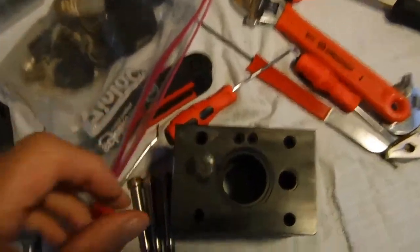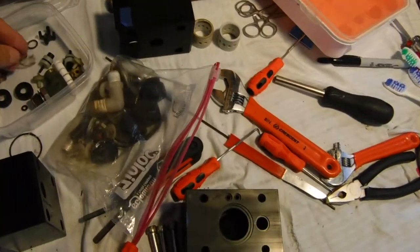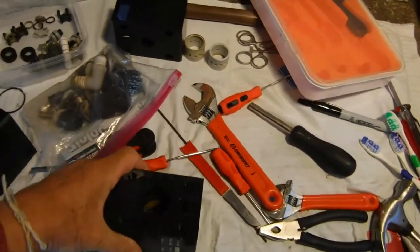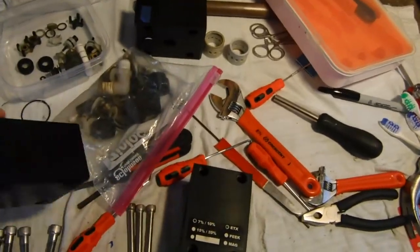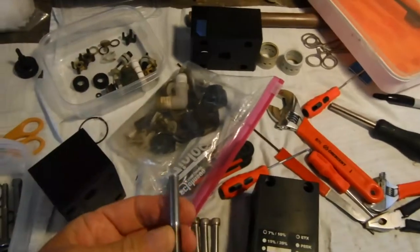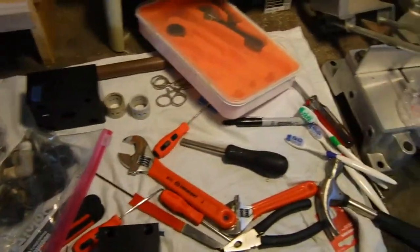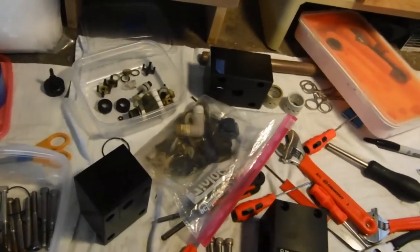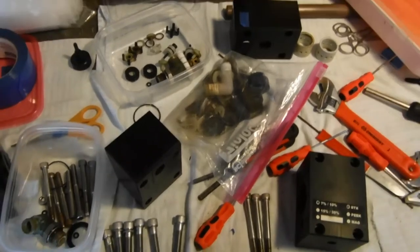That cellophane piece is the culprit. You're supposed to take these o-rings out and replace them every five or six years — of course it's not in the manual. We had phased this out, but you've got to take it all apart to do it, and that's what we're doing, replacing any other parts that need attention. We also had a broken bolt, which I covered in another video. Anyway, I think that debris was the culprit that really got us to take it all apart and rebuild it. We've ordered some parts and we'll see how it all goes.